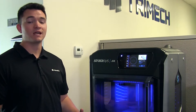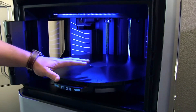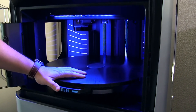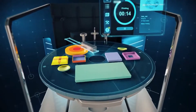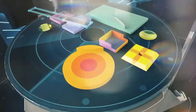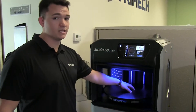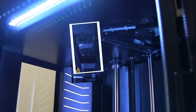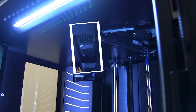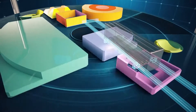Let's take a look inside the J55 and see what makes it so special. The circular build tray has a usable surface area of about 179 square inches and gives us about a seven and a half inch tall build volume. Unlike traditional XY 3D printers, the build volume here is a little less traditional because of the nuance of having the center, which is an unprintable space. One of the other features that makes this printer so revolutionary is the stationary print head, which allows the printer to produce models at such high accuracy, printing at 18 microns.